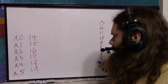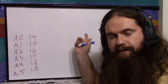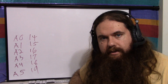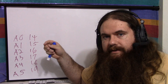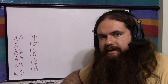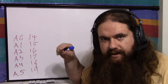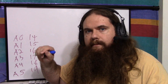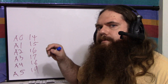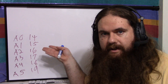All of the remaining pins 2 to 19 are digital pins. Some have analog functionality as well, some have PWM functionality, but all function as digital pins. Using them as outputs, you use the pinMode output function — this is low-impedance, so if you have something low-impedance connected to it, it's going to fry, so be careful. To set the output, use digitalWrite. You can say HIGH or LOW, or 1 or 0. Both work. That's the extent of output — it's pinMode and digitalWrite.